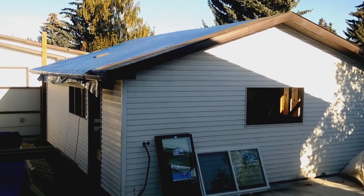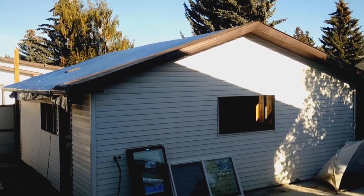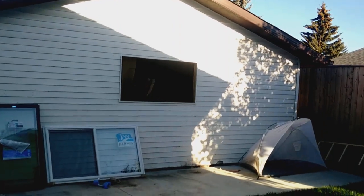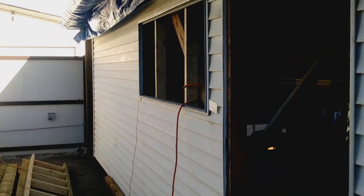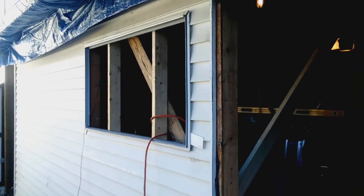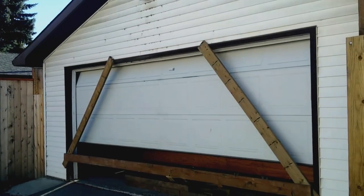Step one, as you can see here, is to remove as much weight as possible. On the outside I removed the shingles and tarped it up. I also removed the windows because when you lift you're probably just going to smash those, so I took them out and ordered a couple of new ones — some skylights for future upgrades. I also reinforced the window openings once they were removed, just to make them stronger, because there's going to be a lot of pressure lifting on that wall.